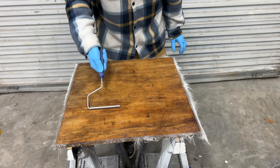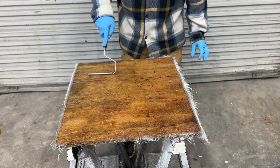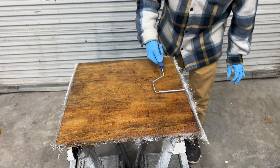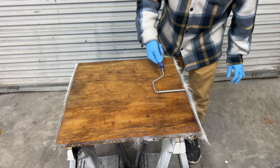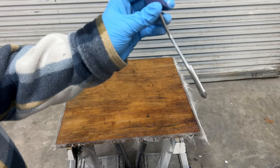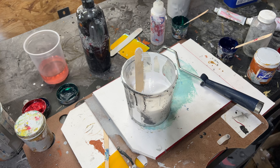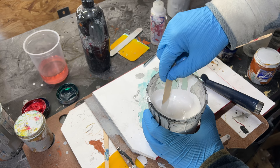The next step I'm going to show you is a little trick that will save you a lot of time and hassle applying gel coat directly over top of this. When is it okay to apply gel coat directly over fiberglass without having to sand the fiberglass first? I like to take these rollers and squirt them down with solvent, then dip them in a cup of solvent to preserve them — they're not really cheap and it's not worth buying the plastic ones. So we're back over here and I've poured in some gel coat.